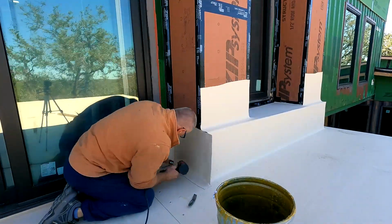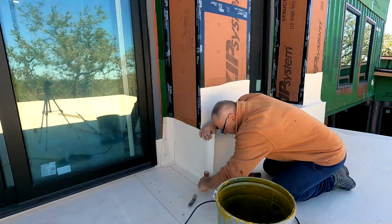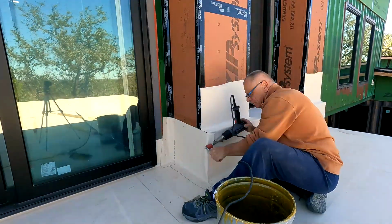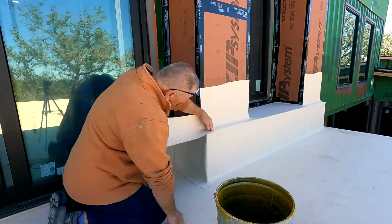You can tell when it welds. It gets soft. I did try to pry it apart, and it did the trick. But here, see what I'm doing on the corner. You just heat it through. I have the gun on full max heat and full air, so off I went, and just rinse and repeat on that.